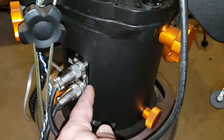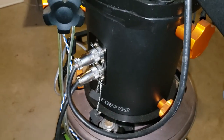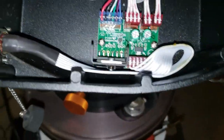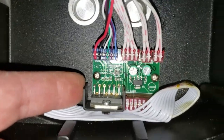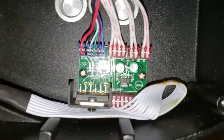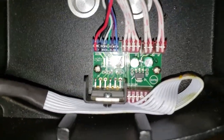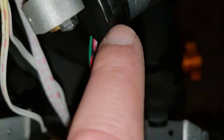You actually have all the digital logic in here — so your error 16 and 17 that you traditionally get talking to motors, that's back in here. All that you have on the drive board is the actual drive chip, which is what actually drives the motor. It's probably just power supply regulation. All of that comes in and this is just your encoder and motor going up here, most of it going to the encoder on the back of the motor.